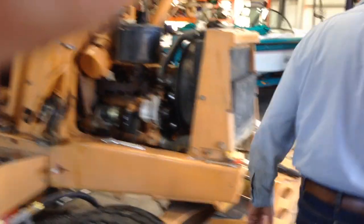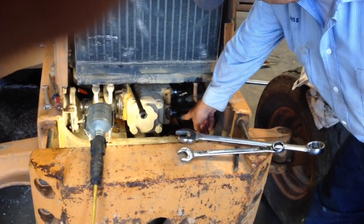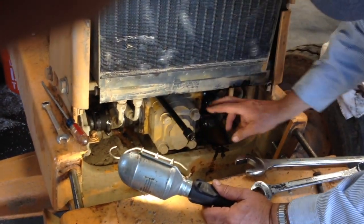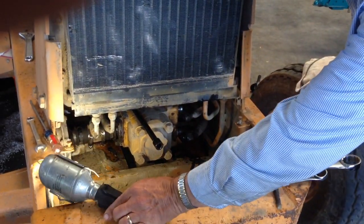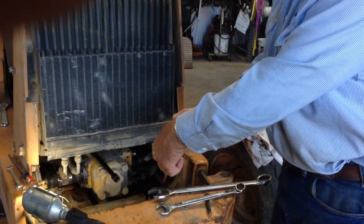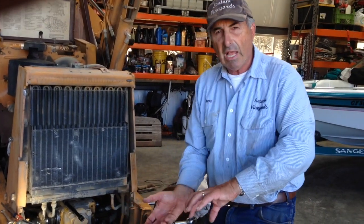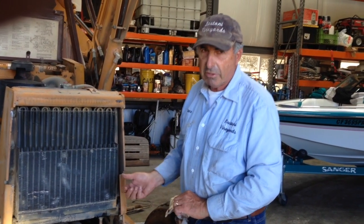Using an inch-and-a-half wrench and a one-inch wrench, we've removed the two hydraulic outlets, and using just a screwdriver on these radiator clips, we have loosened these two hoses — this pump is now disconnected hydraulically. The only thing holding it to the tractor is two three-quarter-inch bolts on the top and three-quarter-inch nuts on the bottom. We'll take the nuts off and remove the two top bolts, and the entire hydraulic pump should slide out of the tractor, exposing the pulley, which will allow us to put on a new fan belt.